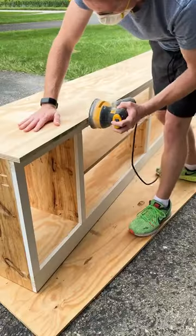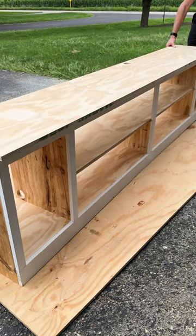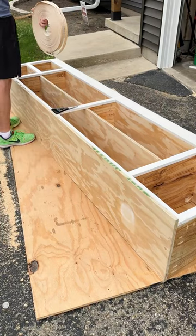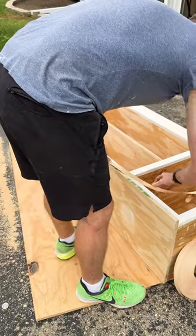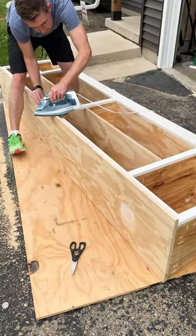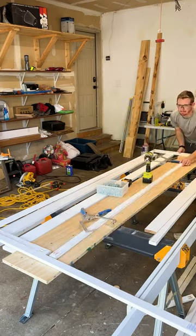The cabinet is all assembled, but I did a few other things to prepare it: sanding all the surfaces smooth and drilling holes large enough for cables to run through the cabinet, because I always forget to do that until later. And because I used plywood, I wanted to cover up the plywood edges by edge banding it — that's as simple as heating up an iron so the glue melts and adheres to the edge of the plywood for a nicer finish.